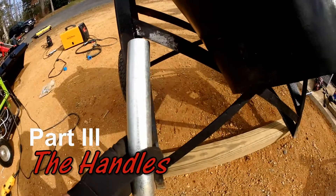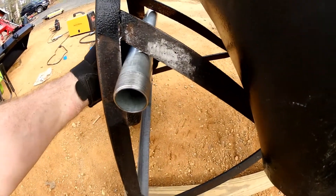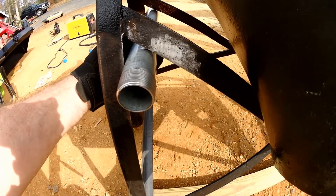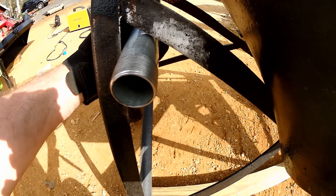Here's the plan for the handles. I think I'll use this inch and a quarter steel pipe as a guide channel. I'm going to weld it in here, and then we can slide the one-inch pipe — it fits exactly in there, nice and tight. I'll put a little hole on the end and put a hitch pin down through there to hold it in place. That way you can take it out when you're working and the handles won't be in the way.